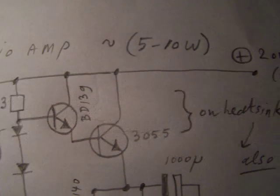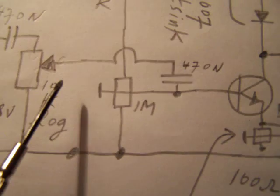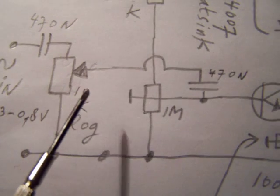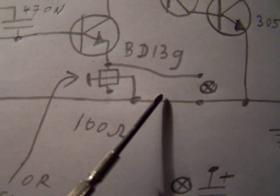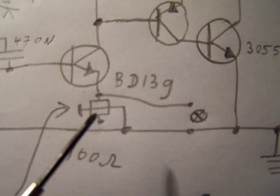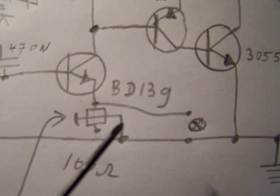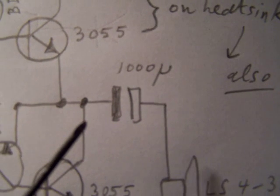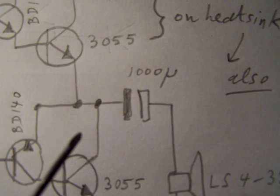I'm going to show now the frequency response of the amplifier. I added a resistor here from 3K3 to make the amplifier more stable, and you can add a capacitor from 220 microfarad parallel to the fixed resistor of 27 ohms — then you get more medium frequencies out. You can raise the value of the output capacitor to 4700 microfarad. It gives a better overall frequency response. I did it.